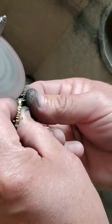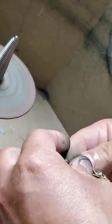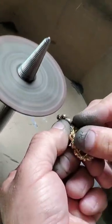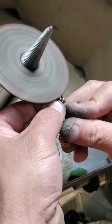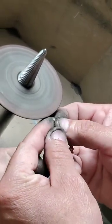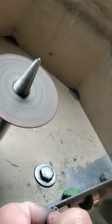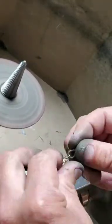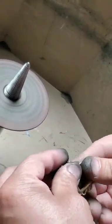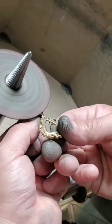So right now he's using again the lapping machine. He's slowly eating the sandpaper that we did. We did the correct cleaning of that sandpaper away, and he's making it a very, very smooth surface. When he comes back and does the buffing rouge, it's gonna smooth it up and make it look really shiny and nice and flat, a beautiful flat surface.